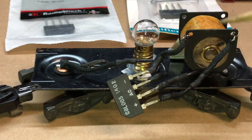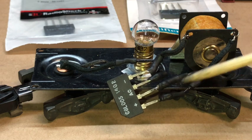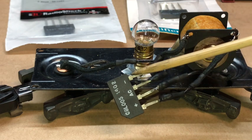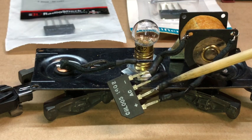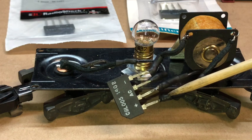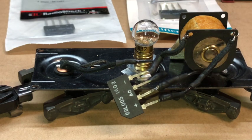Sever both wires that come from the solenoid. The one that normally goes to the rear truck, attached to positive. The one that goes to the front truck, attached to the furthest most negative. Then complete the circuit for the furthest rear truck by attaching it closest to the one that had gone to the rear truck. And of course, that only leaves this one in the process of elimination, and you're pretty much done.